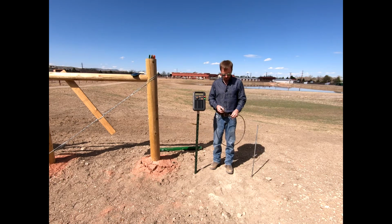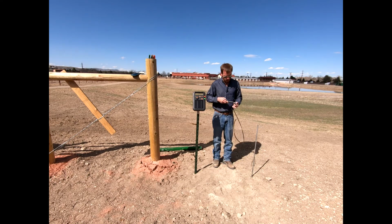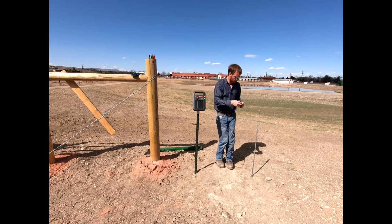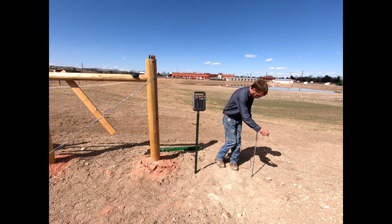For the sake of doing things today, now again, if you hook this up to your grounding rod, these are really cool ground clamps that you can utilize. And so these traditional ground clamps, they swing open just like so. They'll connect over top of your grounding rod. We'll snug this back down. Again, these are all a galvanized connection here. We don't want to use anything that's copper. We don't want any dissimilar metals.